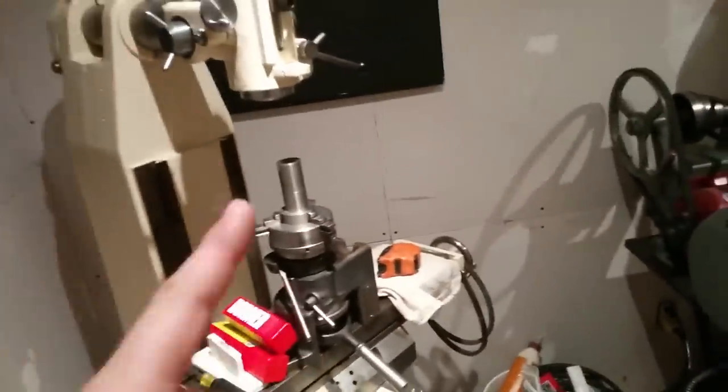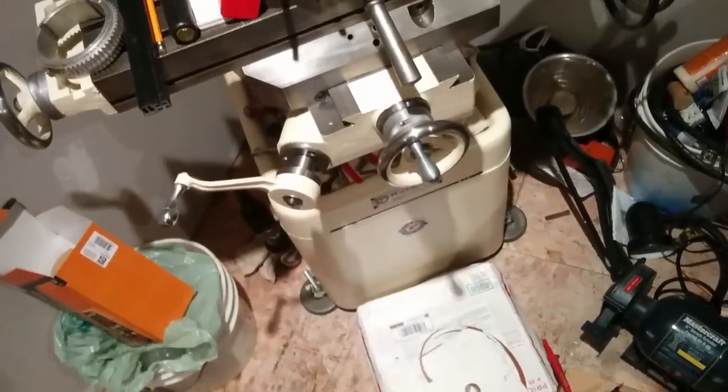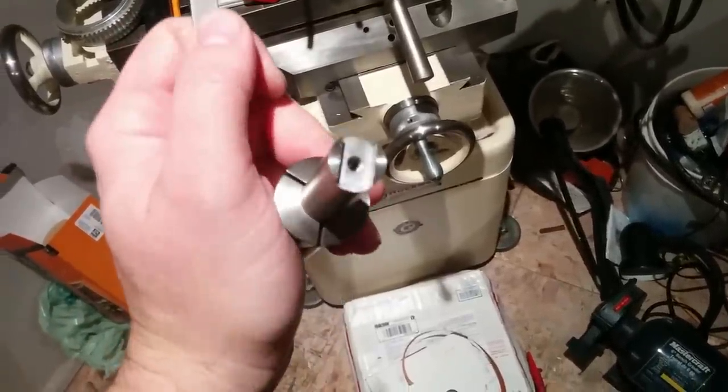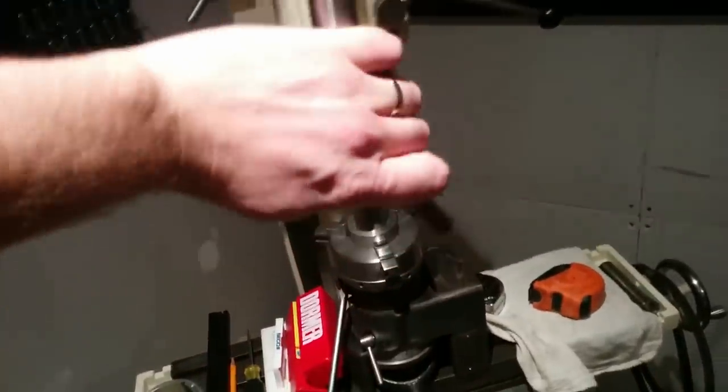Good morning. I'm looking at a Rockwell 2100 and I've got myself all ready to go. My last step was to create my tooling - my spline cutting bit. Here it is, almost done. It's nothing too tricky - it's just a 5/8 shaft with the keyway cut in it, and I drilled in a 10-32 on top, so that's going to flop up into my quill and hold my tool.